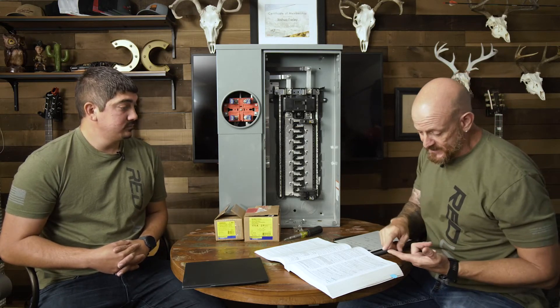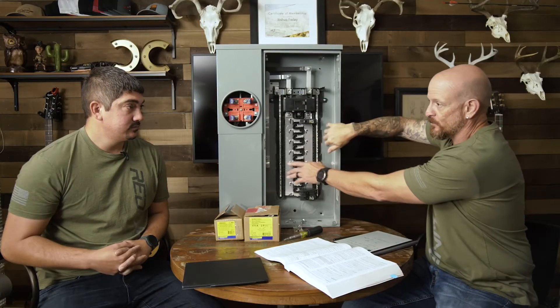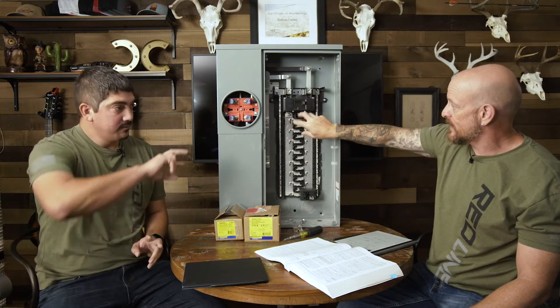The code states that where a primary power source and another power source are located at opposite ends of the bus bar that contain loads, this has to be way up at the top and on the opposite end — that's the rule for using that 120%. They do that because if you put both of them at the same end, your potential for overload in that area increases versus having it dissipate throughout, because you have branch circuits pulling from your spa, pool, microwave, outlets — and during the day that power gets distributed as it goes back. So it doesn't go to the grid — you're using it. Having them at opposite ends prevents overloading the bus at one location.